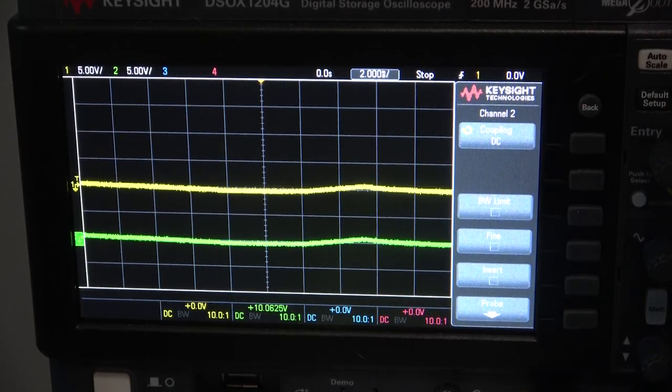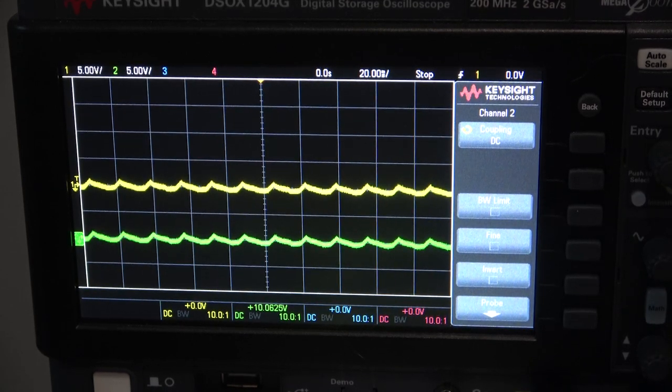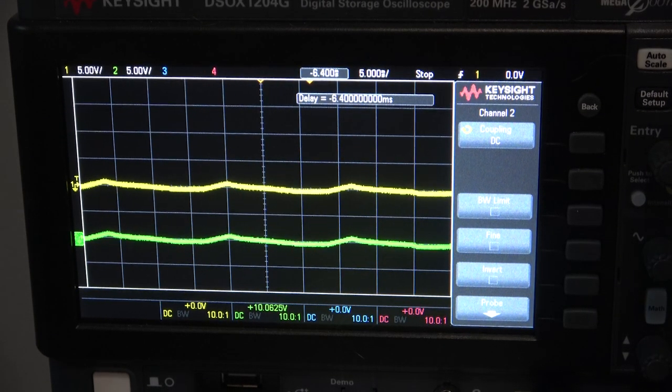And I got the scope here. I noticed some wavy lines on the screen, and I was like, what are those? And then I remembered, oh, there's a Nintendo cable attached to this. So let's see if we take one divided by 60, what is that? That's 16 milliseconds, 5 milliseconds of division.